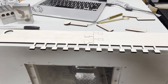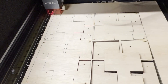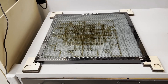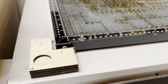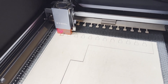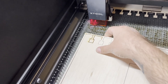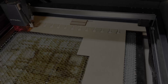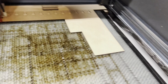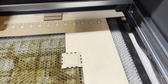Before my next project, I made a few improvements to the laser setup. The YouTube channel The Clack Shack has a ton of useful videos about this and other laser cutters. He also sells jigs and accessory files over on Etsy, so I bought his universal jig kit, which will make future projects where I have to make multiples really easy to align. I also bought his files for the honeycomb mount for the D1 Pro. The issue with the honeycomb is it's not fixed in one place relative to the machine, so this kit allows you to both secure the honeycomb to a fixed location relative to the machine, as well as raise the laser up to regain your maximum material height that you lose when using the honeycomb. The universal jig basically makes a zipper-looking rail along the top edge, and then your jig panels can clip in, allowing you to repeat cuts or engrave in the same spot without needing to adjust any settings since the last time you used a particular jig.